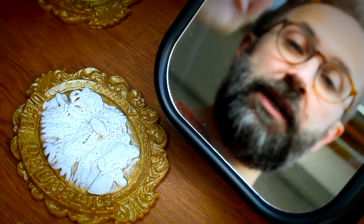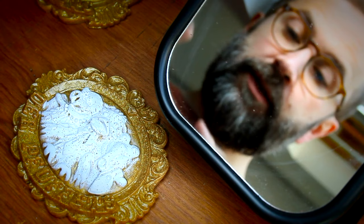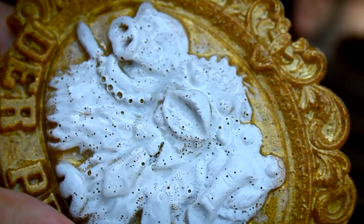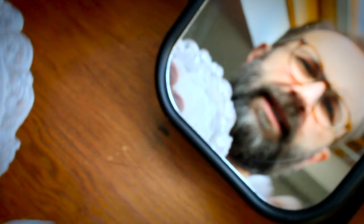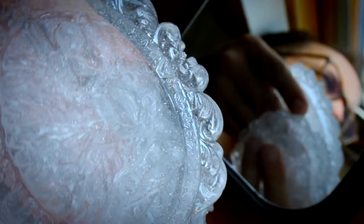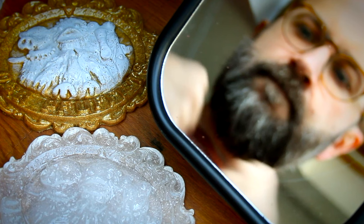One final addendum that might be informative. The finished product is drying outside with two layers of gloss on it, all painted up. I have cast some more - I mixed in quite a bit more mica powder, but also a little very old antique gold paint. You can mix acrylic paint with resin, but they're particularly bad together. I've done two more in clear resin. I did put in a tiny bit of white acrylic paint - I don't know why I didn't learn my lesson - but these are much, much better. For the rest of my batch I'm going to go pure clear resin, prime and paint the whole thing, and not mix anything in. Learning. Always learning.